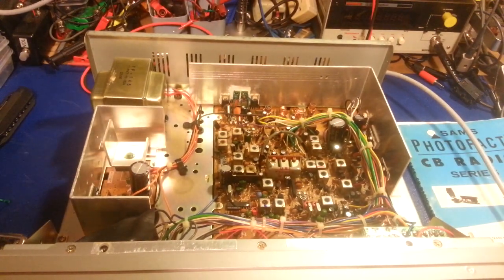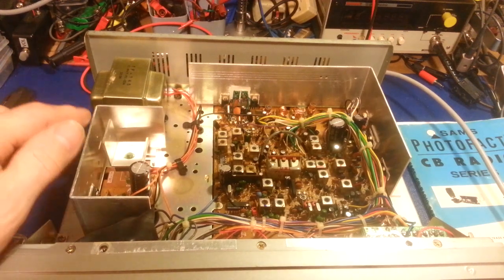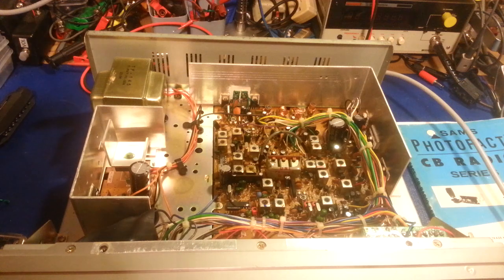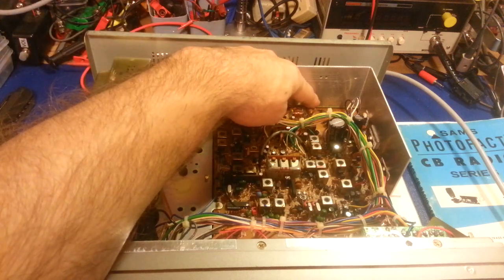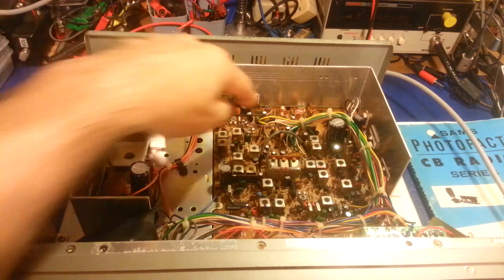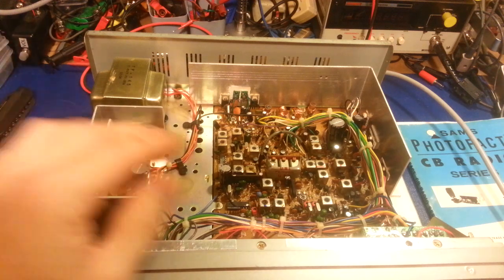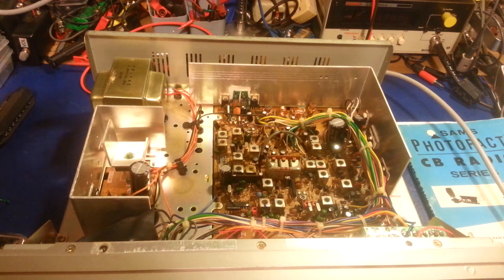The clarifier range was really tiny and it had this radio all screwed up. This was definitely a screw-turner radio — they had the power supply voltage set at about 18.1 or 18.2 volts, way too much. It's supposed to operate at 13.8 volts. I got the coils straightened out and had to tweak them along with the trap coil to get the second harmonic frequency down — they had the coils spread as far apart as possible. Surprisingly, they hadn't clipped the ALC or AMC limiters; the pots were turned to full rotation so it was horribly over-modulated, but since the limiters weren't disabled, it just needed proper adjustment.